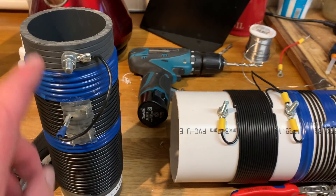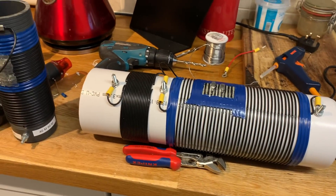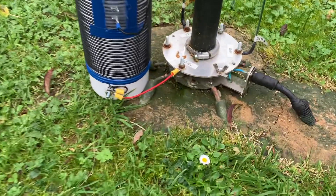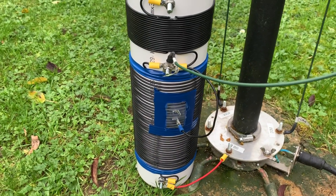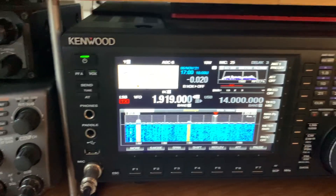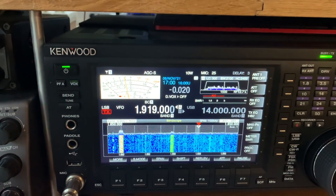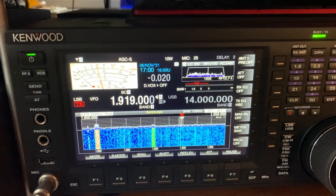We'll put them all out and test them. What we've got is the driven plate going into the bottom of the coil, tapped at the 49 microhenry point. The top of the bottom coil is now connected up to the 80 meter inverted L, which goes over to the house. We'll find out. The lowest I can get the SWR is around 2, which is fine if you've got an ATU built into the radio — you can hit the ATU button and it would tune it in perfectly.